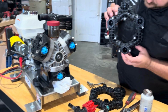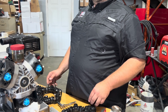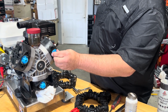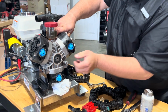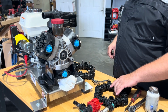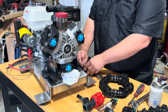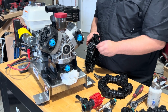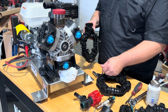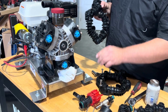So we have nothing left but just the bolts here. Check valves are all in place while you do have this off. I would take a quick look at these check valves. They're very easy to remove. Just pop them out, seal in there around them as well, pop back in, make sure those are all good to go. New manifold, new bolts. Make sure you get the washers back in place.